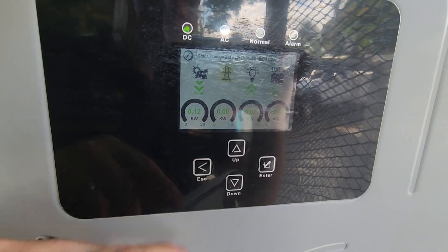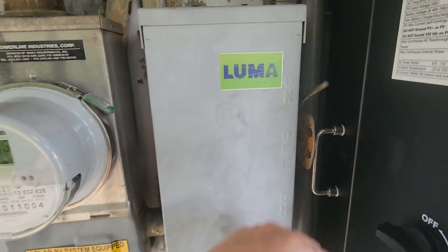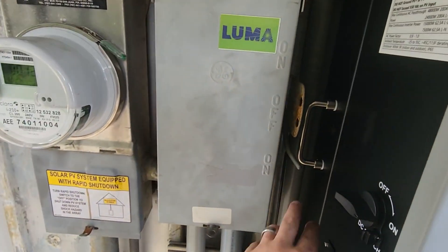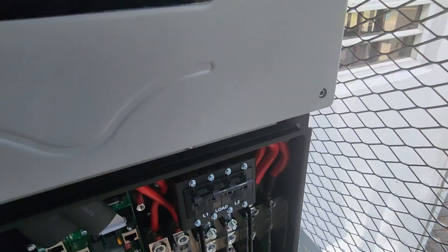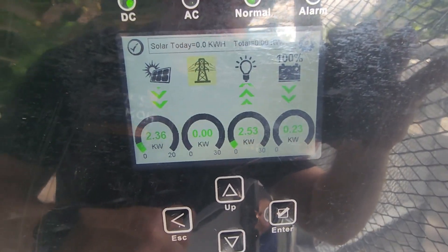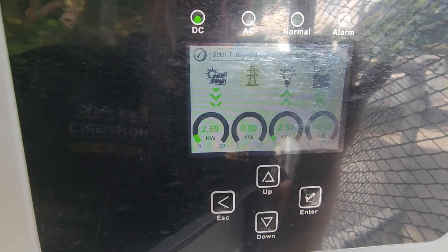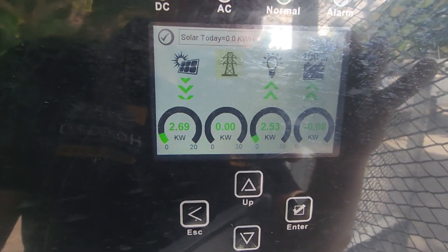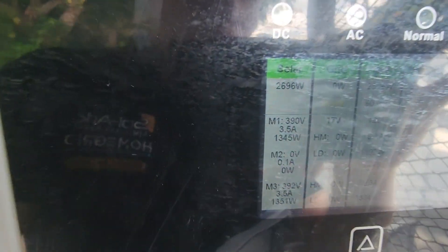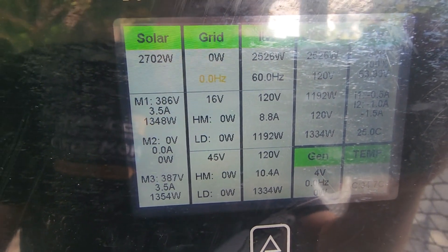That's all the settings for now. We are going to energize the building using battery and solar. This is a bypass switch — right now the system is bypassed. When we turn it down right here, we are going to energize the building using the system. You'll see that the production goes up because it limits the power to the load just as we set it up — that's normal. That does not mean the total capacity of the system is 2.7 kW; it's just supplying the loads and the battery as necessary. I'm going to make sure the grid port is de-energized — we're seeing 16 volts and 45 volts, those could be false readings. What we are looking for is that we don't have 120V on those lines. Looks good.